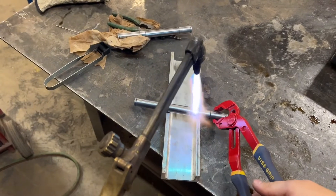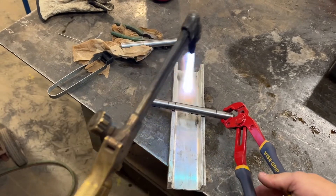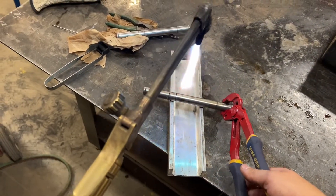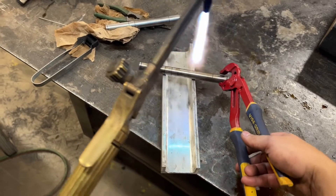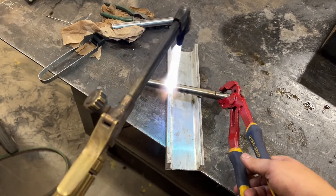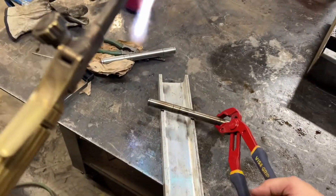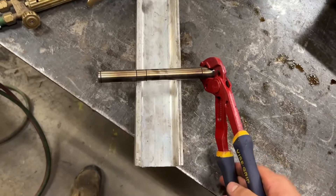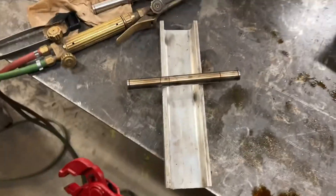The reason you want to do this in an oven is so it's uniform — it's kind of hard to get everything uniform any other way. So you can see there are some sections of blue, and we're getting into a dark straw color here. Let it sit for a second and get the heat to soak in. You can see it's slowly getting all darker straw brown.